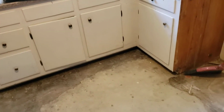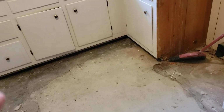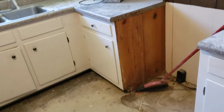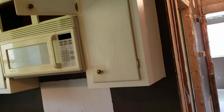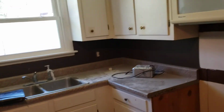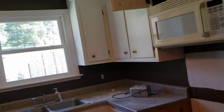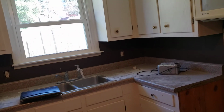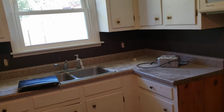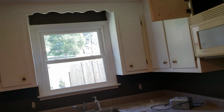We will not need quarter round in this one. Customer is having their own Pergo top floor or laminate floor put in that's pre-padded, and because of that, they'll do their own type of molding on the bottom, their quarter round, but we want to make sure we have plenty of scribe molding for all these exposed ends. 1, 2, 3, 4, 5, 6, like 5 pieces of scribe molding. Also make sure we have crown molding, enough to do all the returns. And as well, make sure I have at least one extra 6-inch filler. I know they don't come in a 42, but if I can have a 630 or at least one extra 6-inch by 30 filler, that way we can do all of our return blocking that we need for the crown to ride on the tops of the cabinets.